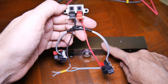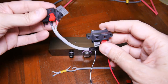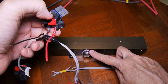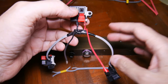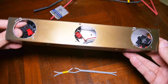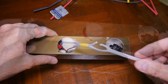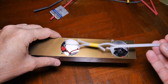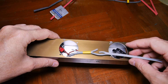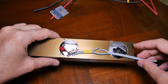This is the wiring harness as it's going to go into our project box. This is the right side set of contacts, left side set of contacts, and center contacts. This will go to the output of our voltage regulator, and this of course will go to the ground. Here's the wiring harness laid in place — it's not nailed down yet, just getting a rough idea. Everything fits in there: one, two, three. The harness will come from the solar panel, the split wire goes through the fuse, and the other wire is the negative. Need to solder all this into place — getting close to being done.